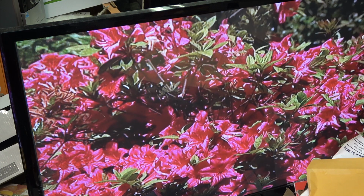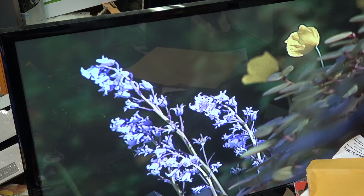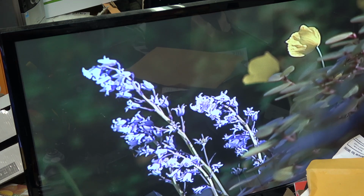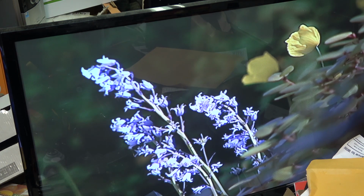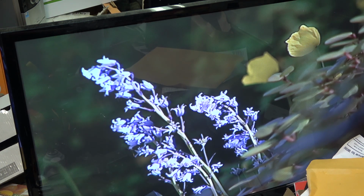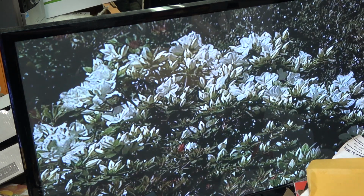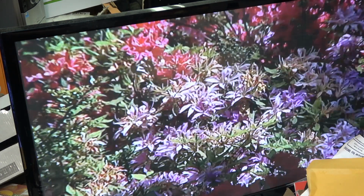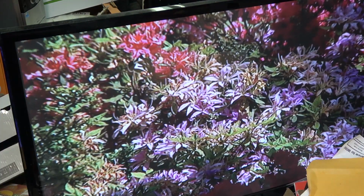And using them occasionally when it's necessary, the idea behind it is they'll rub the contamination off the head and not damage the head. But again, you run them for 5 to 10 seconds, and you don't do it more than 4 times. The instructions are you can use it up to 4 times. If you do it 4 times and the heads aren't clean, then get your camera or tape player serviced, because it's not a dirty head, because these will clean it.